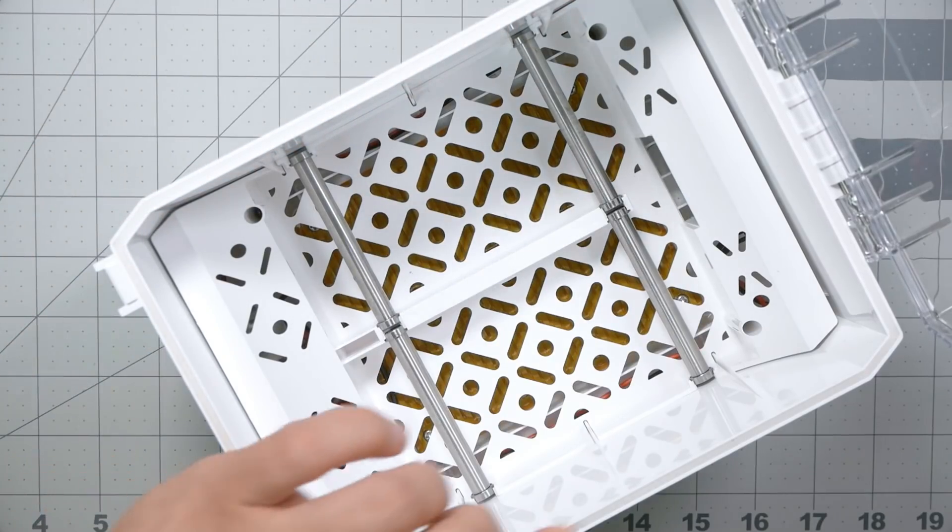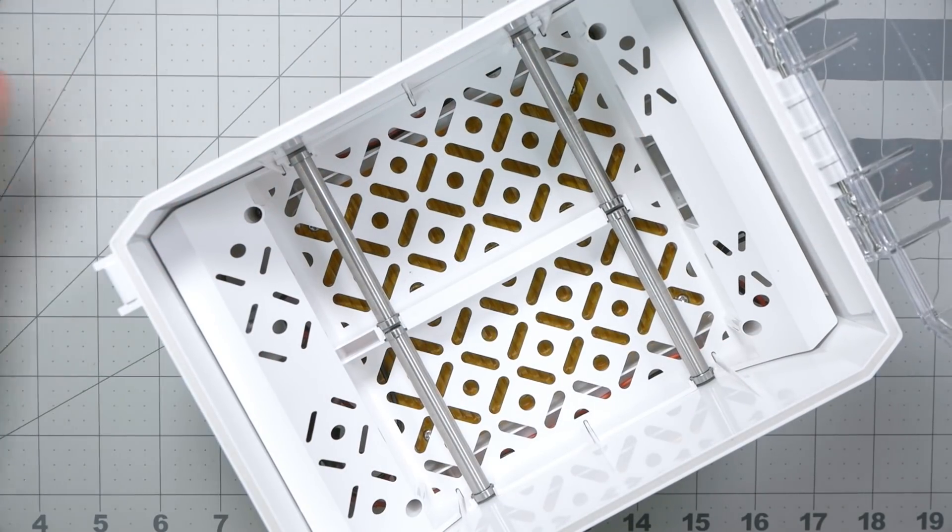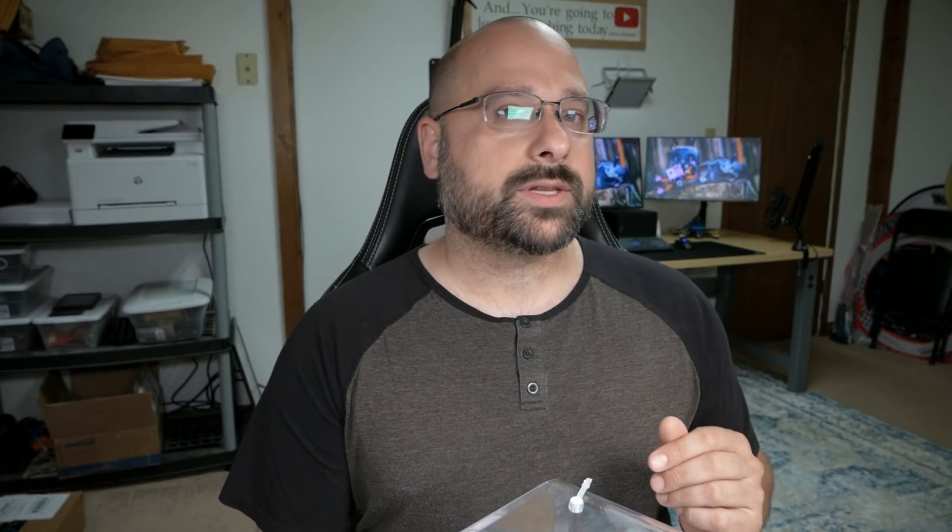It does have a silicone seal to help keep environmental moisture out when you're not using the heating element for extended periods. The other big thing the Sovol doesn't have is a scale — and I think this is going to be a real differentiator for a lot of people. If you have a scale and know the tare weight of your spool, you can know exactly how much filament is left. So when your slicer says you're going to use 47 grams of filament, you don't have to wonder if you have enough left — you just know. That is a super, super cool feature.